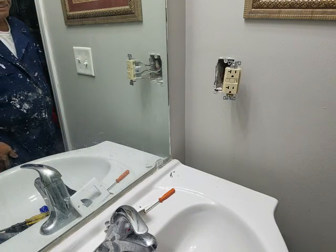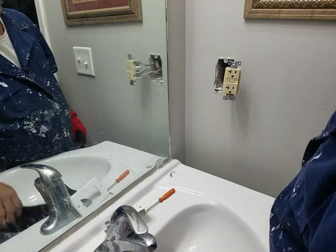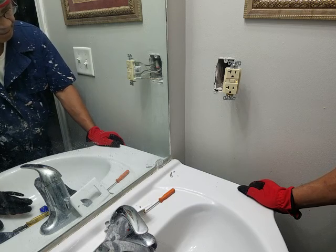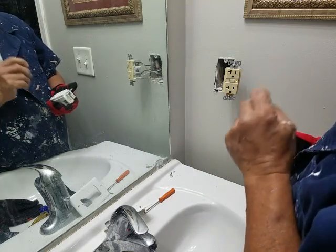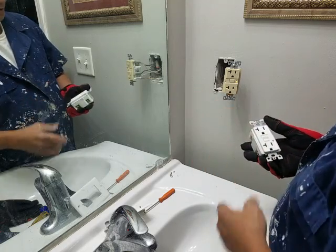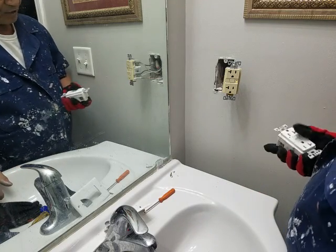There you go — she's got that light on now, so it's working! What happened was that in our master bedroom bathroom, every time we plugged in electrical stuff like a hair dryer, this thing would trip. 'Trip' means it popped off. The contact on this GFI had already gone bad because after a while there's a little bit of sparking and arcing inside. The contact on this one was already bad. These are in a price range — I bought the expensive one at $29 because I know it's a lot better.